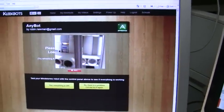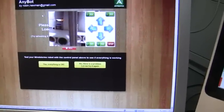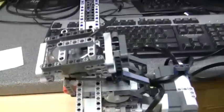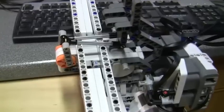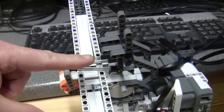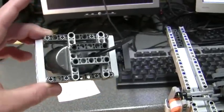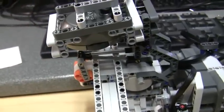So I'm going to go on to the next screen which shows the control screen. You can see in the right-hand area there is a video feed from the camera. The camera is just sitting in a cradle here. This is a regular model that I've used which normally has the Lego colour sensor down in this area, but so that we can actually transmit the pictures being seen for control purposes, I've replaced it with this webcam and designed a little cradle for it to sit in, looking at the runway in the same way that the colour sensor normally would.